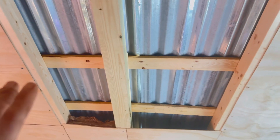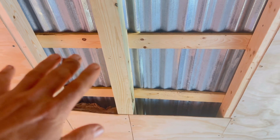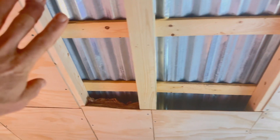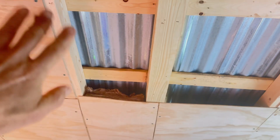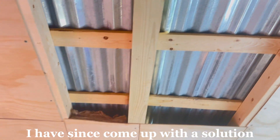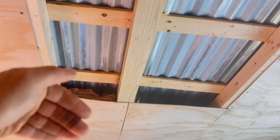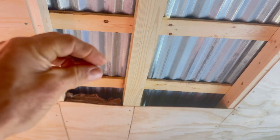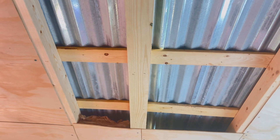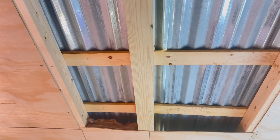The other solution — I've seen people try putting a three to six millimeter vapor barrier up there, but all that ends up doing in the long run is creating sweat at the vapor barrier level because it's not actually attached. Now there is some sheet metal you can buy that already has a felt attached to it, but it's expensive. The other solution is you take it off, or when you're building it, you put a very thin vapor barrier — kind of foam, just like a koozie — and it will solve that problem.